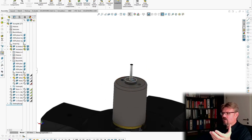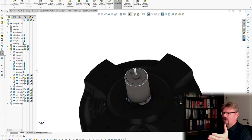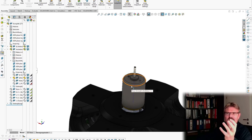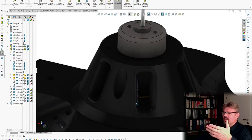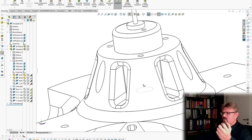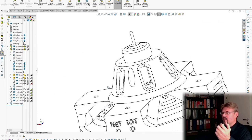This has now a 2.3 millimeter shaft, I think. I'm not sure. Yeah, this is the motor, and it is also round. So we have to have another form of preventing a twist of the motor. So actually here, this is the part, and since the motor has now more power, I have decided to make ventilation holes here, so that the motor is cooled better.